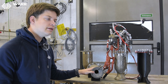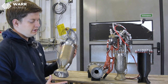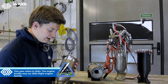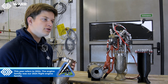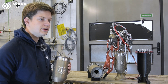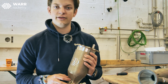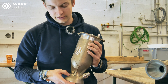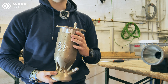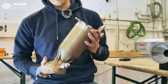Based on that design, we did an improved version for EuRoC 2024 — this is the engine family of this year. We have two engines due to a manufacturing defect in the ports at the throat that we added. We experienced some really tiny cracks at the top of the port and inside these decorative elements, where we simply did not fillet them enough or provide enough cross-section for a smooth cross-section transition.